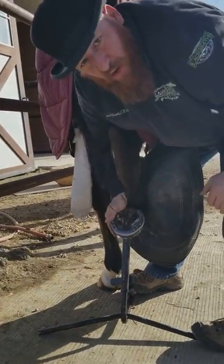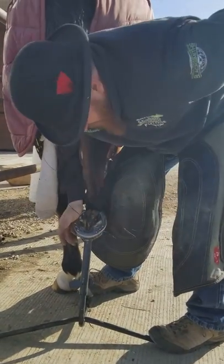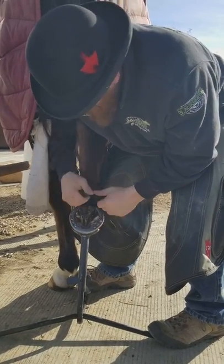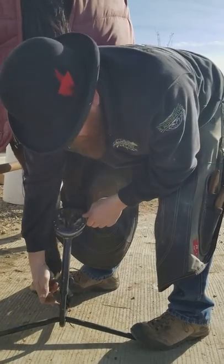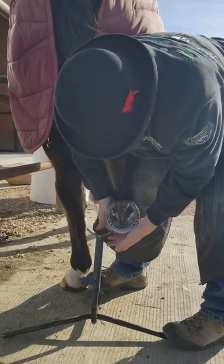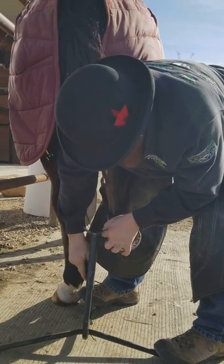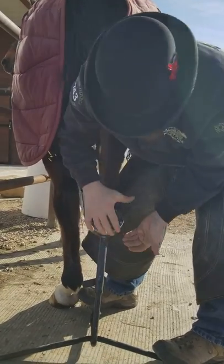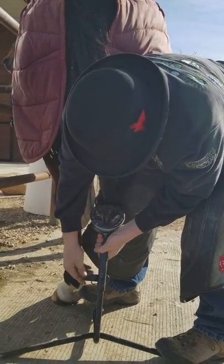I don't work on a stand or on a cradle very often because it's hard on my back — you're bent over instead of having your butt under you. But sometimes it's just easier to pull off this way. You can see in my stand right down here you can cut two more inches off this peg, and then the cradle adjusts up and down. If you've got one where the foot turns out, you just give the cradle a twist to get it lined up with the foot so it carries good, then lock it right back down.